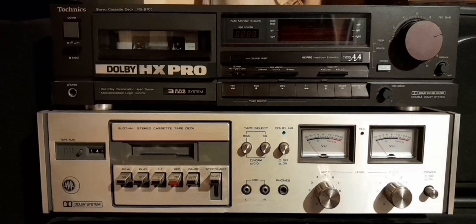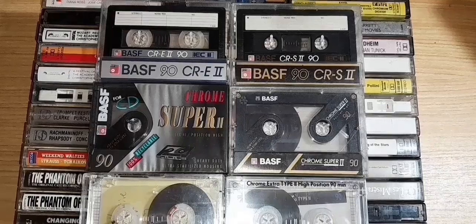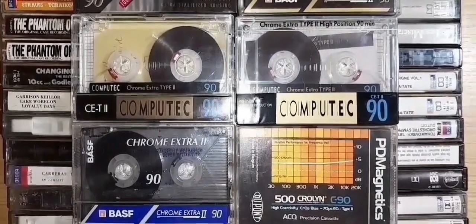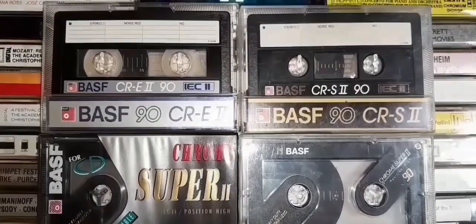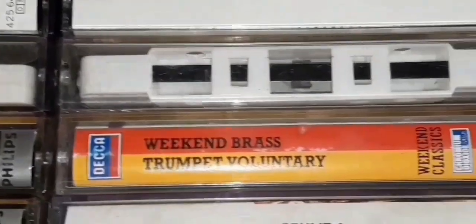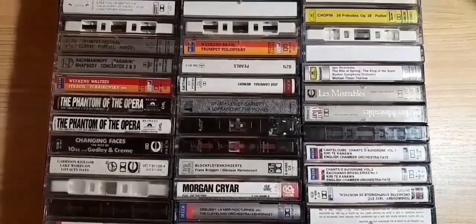In this video, I'm going to attempt to record on an old school pure chrome cassette at 0 dB level. When it comes to true chromium dioxide type 2 cassettes, most people into this format know they are superior to type 1 cassettes. However, not everyone knows this, but chromium dioxide cassettes also have the lowest noise floor of all cassette types, including metal type 4 cassettes, and way lower noise levels than type 1s and other non-chrome type 2s.